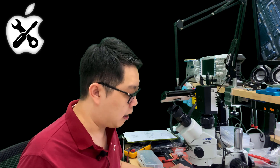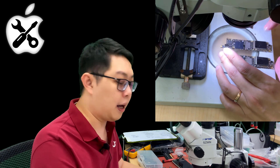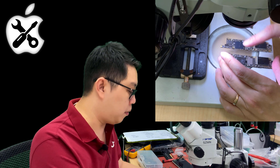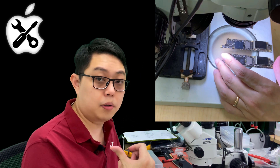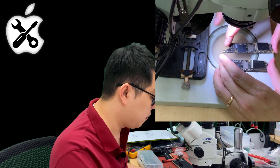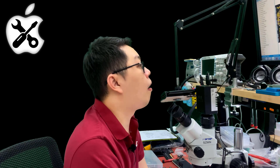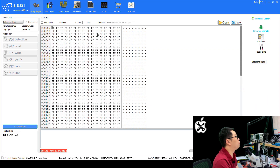I still have these tools because, for example, if I want to do a board swap — swap the CPU into a different board but don't want to remove the EEPROM — I can just back up the EEPROM using these tools, then flash the encryption file into the new board's EEPROM. The encryption file contains a lot of random code that you wouldn't understand at all.